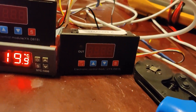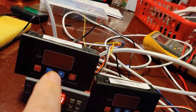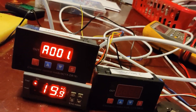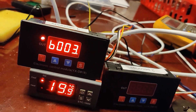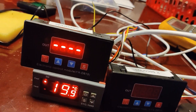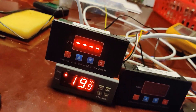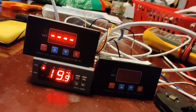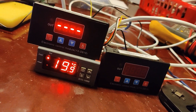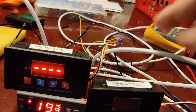I'm going to power this up. The four-second one is going to come on first — there it is. It went through phase A, now B is counting down for four seconds, and now it's finished timing. That one is tied to the cool relay — to shut the heater off when we're in cool mode. I'll probably have to readjust the times to get it right.